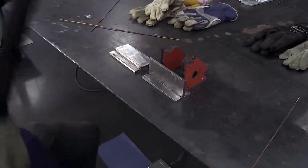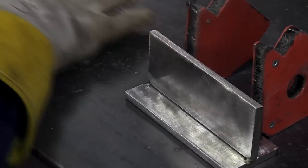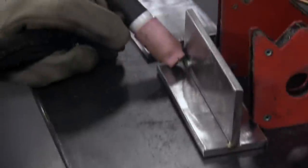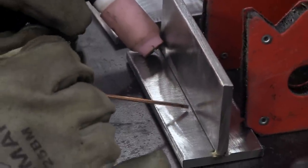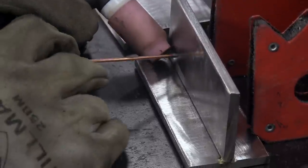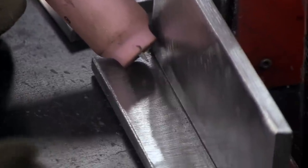You guys may remember me talking about adjusting the electrode. When we were welding that butt joint we were fine, but in here we need to get all the way into that corner. We need to be directing our arc right into that corner. Right now we're a little too far away — what's going to happen is the arc is going to be bouncing around and wandering, trying to find its home where it wants to be.